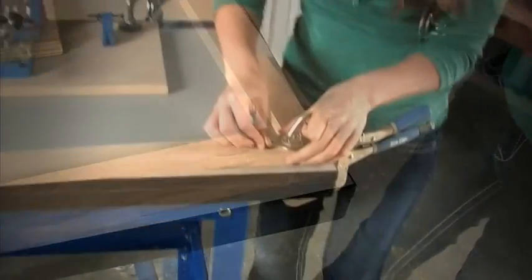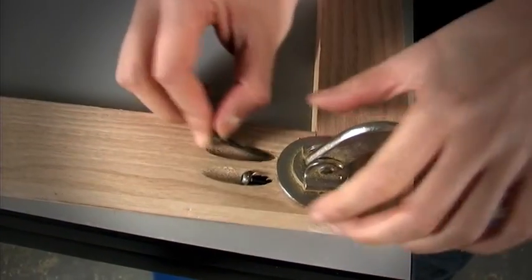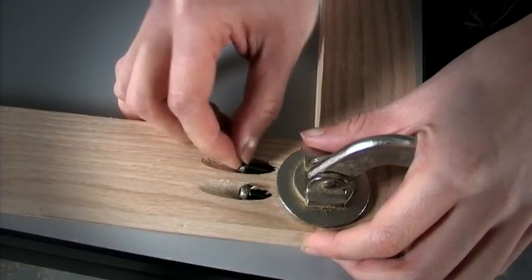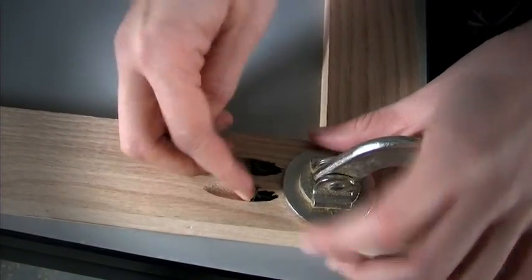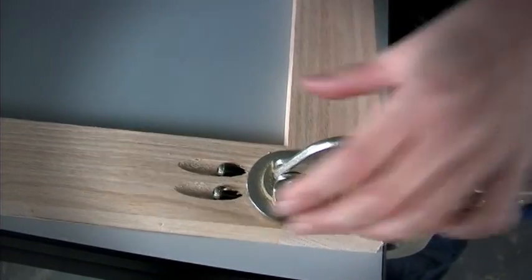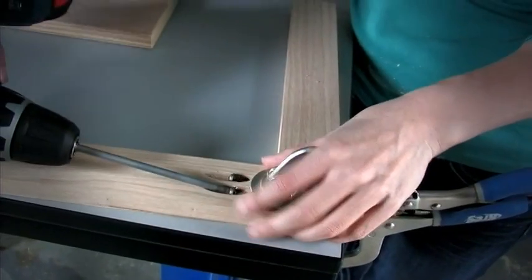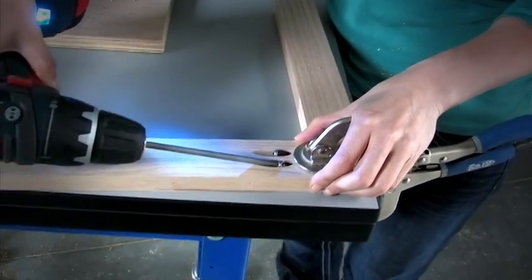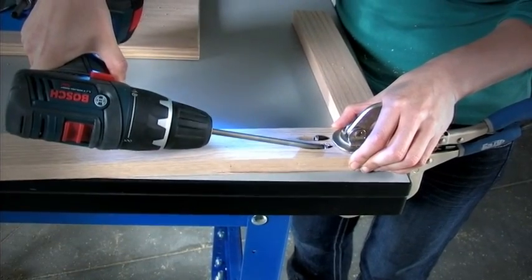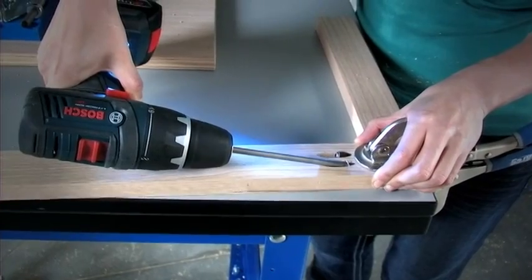When you insert the screw into the hole, you will feel a smaller hole inside the larger pocket hole. This is where the tip of the screw needs to be inserted. Okay, so it'll be at the right angle. Right angle, not as in a 90-degree angle, but the correct angle. And then just slowly drive that screw. Gotta apply pressure. Just nice and slow and easy.